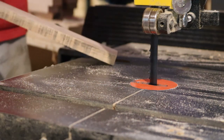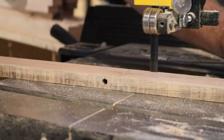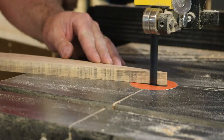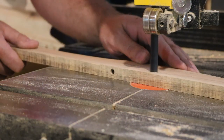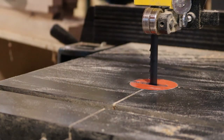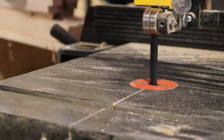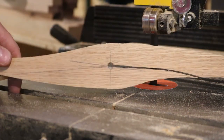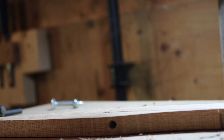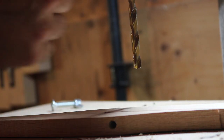Now to cut out the shape, and cutting the relief cut in. After a quick test fit, the rod is still too big to fit through that hole even with the relief cut — I did that deliberately so it couldn't be too loose. So now I'm going to drill a slightly bigger hole and retest it.